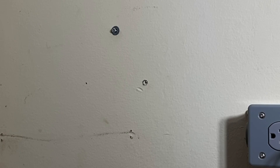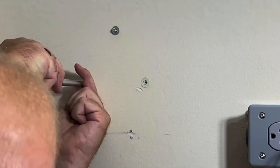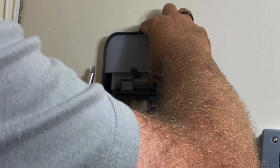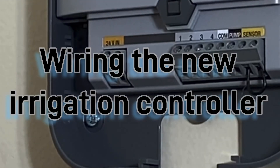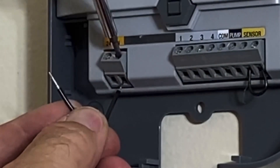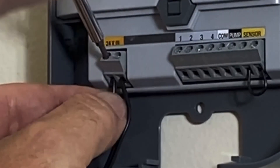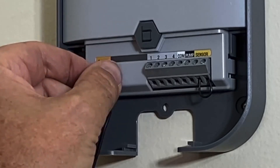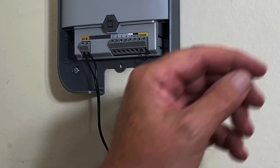Pre-start the hole with these things — it keeps the drywall from buckling out. One under each. Go ahead and pull on them, make sure they don't come out, make sure they're tight. You don't want it too tight because you don't want to bust these plastic connections, but you don't want it too loose. The screwdrivers are well worth it when you're doing stuff like this.